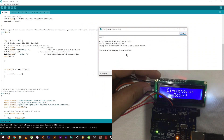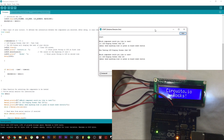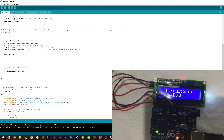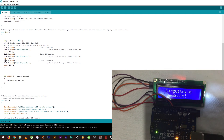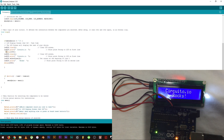Now it's time to customize it a little bit. First, I'm going to add a new line to print on just the first row of the LCD that will appear after the first message. Just copy and paste the code and edit what's inside the quotations like this. Then add some delay after each message. Remember, the LCD is 16 by 2, which means it has 16 characters and 2 rows. So if you want to display a word that is less than 16 characters, you need to add some spaces on the sides to center it.